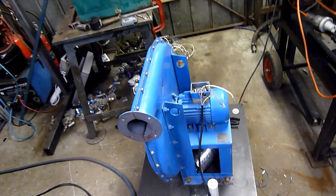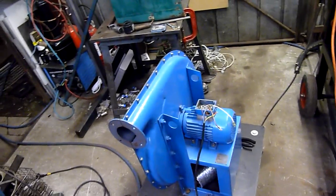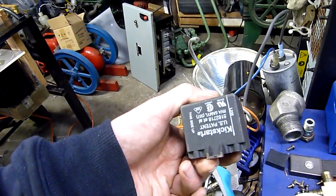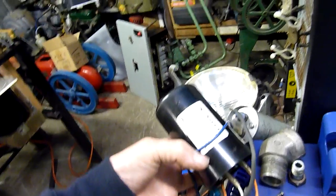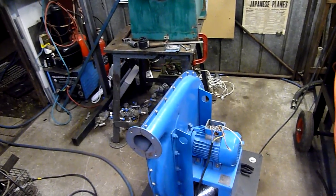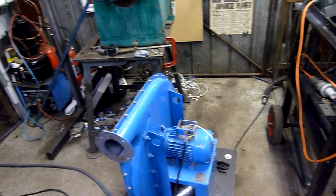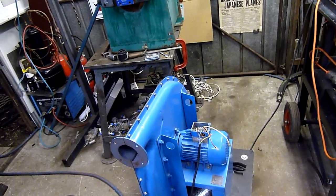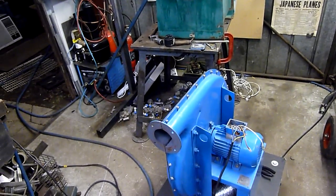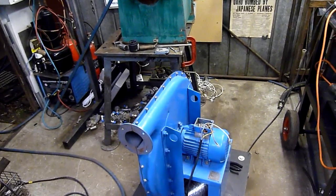As far as starting this is concerned, the blower I can't run on single phase — I'm guessing because it's a two-pole motor. I tried it in star and delta using start and run caps. The potential relay is probably overkill. It's a kickstart kit rated 3.5 to 5 horsepower, and I'm trying to run it on a 0.75 or 1 horsepower motor. I don't think the potential relay is even getting the current flow to trip over. So unless I can find a smaller potential relay, I don't think I'm going to be able to kickstart this thing. It almost spools up — it sounds like it almost wants to reach full power, but the motor gets really hot, so it's not safe to run it like that. So it can stay there for now, and I'll probably park this in the corner for the time being.